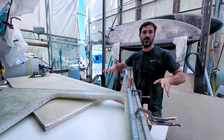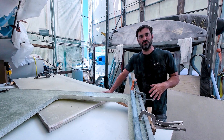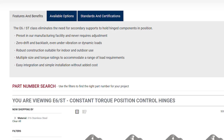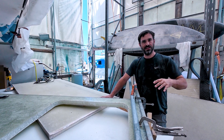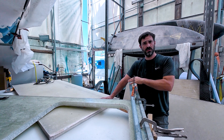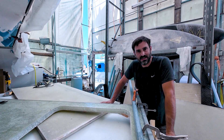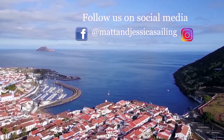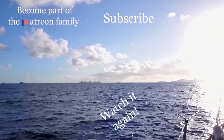We'll get those two hung, and then the center door is the big question — how exactly we're going to hinge it to be able to lift up. I'm looking into some SouthCo hinges which kind of self-support: in theory, if we're raising the door, it will hold it at whatever position we stop at, making it a little easier to raise and lower. I just need to calculate the overall finished weight and the force it's going to put on those hinges — whether I need three of them or if two will work. We'll do some calculations, weigh it out, and get those ordered. We'll see you next time.